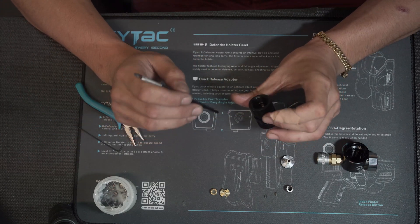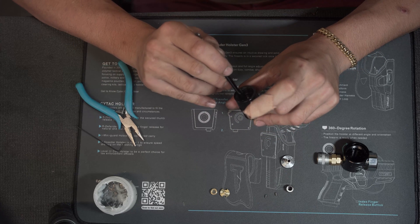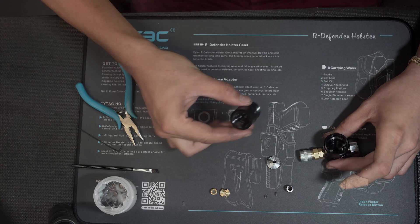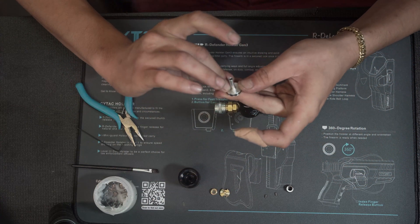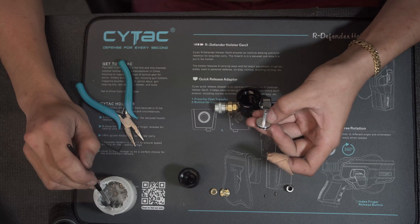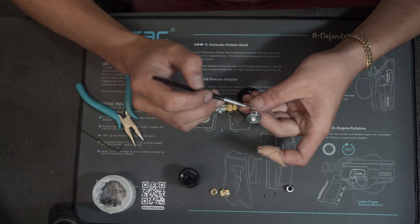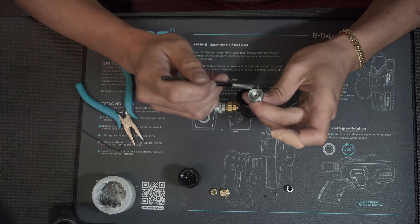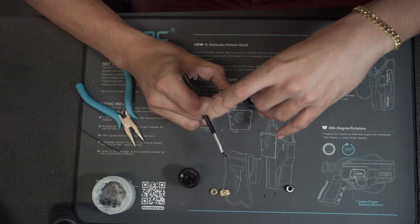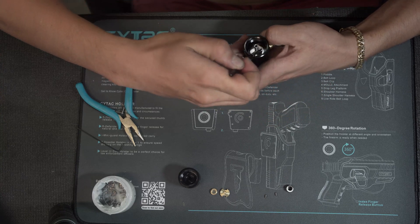When that small o-ring is re-greased, just use the back of your brush and slowly put it into its place, making sure that it sits flush. Once that is done, put that one to the side. Get your piston, make sure everything is wiped off it, and using the smallest amount of grease you can, you just want a very light layer around the o-ring. Another part to coat is just the top of the piston head — again, a very light layer. Place it into the top of the regulator. Just coat your rod as well, as it is making contact with that little o-ring on the side.